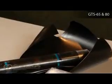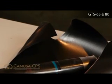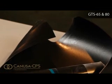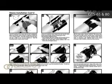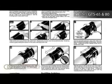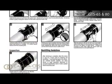A heat-shrinkable sleeve is made of a cross-linked and stretched polyethylene backing coated with a heat-activated adhesive. The sleeve is pre-cut to fit the specific pipe diameter and has a pre-attached closure strip. Always follow the storage and safety guidelines when using the products. This will ensure that the products will be in their best condition when applied.